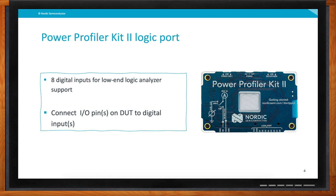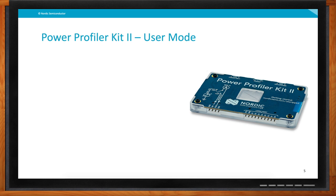You can take any IO pin on your device and connect it to these digital inputs on the Power Profiler Kit, so you can see the state of these input pins as you real-time measure current consumption on your application. You can trigger output when certain things happen. Let's say you've developed your application and you see something going really haywire and you don't understand why — that can be really hard to debug. So you can start to toggle some pins at certain parts of your code, and when you see pin toggles while monitoring power at the same time, you can use that as a great debug feature to narrow in on where something has gone wrong.